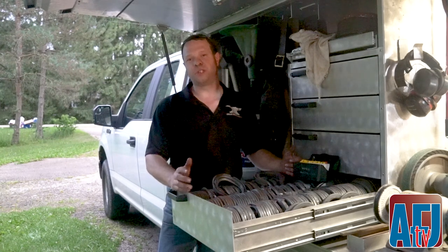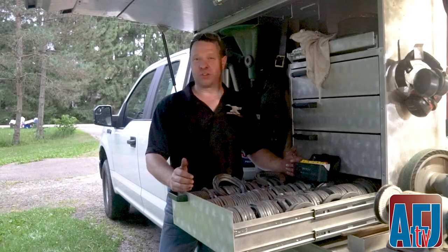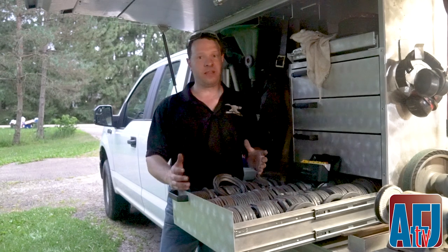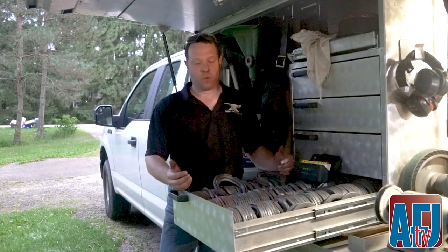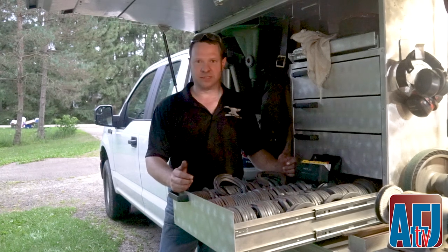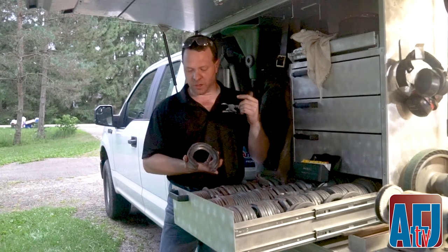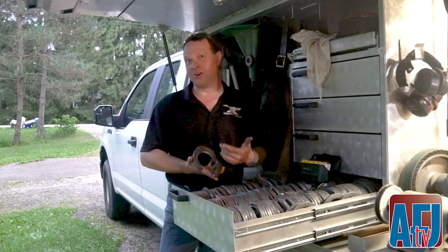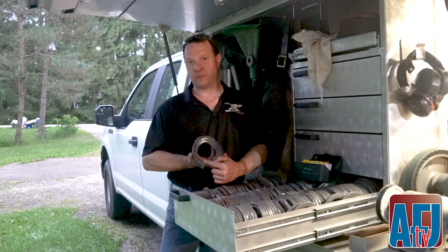It becomes a challenge when you start making handmade shoes for contests, and it's something that I've certainly struggled with. So I'm trying to train my eye to look at feet in steel lengths rather than standard factory keg shoe sizes. One of the things that I learned when I went on the cultural exchange program from Gary Darlow back in 2006 was how to mark shoes so that you can pick up a shoe and remember exactly what it is. In a way, it's sort of like cheating, just like having a 1 or a 2 or a 3 on there. But what I've done here is I put my lateral branch mark here at the back.